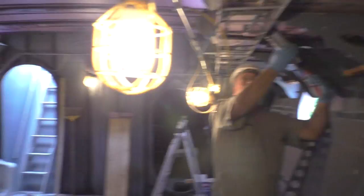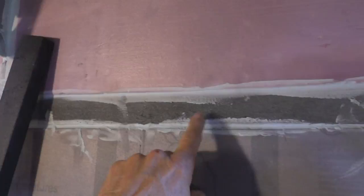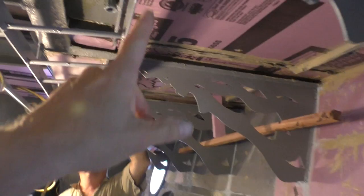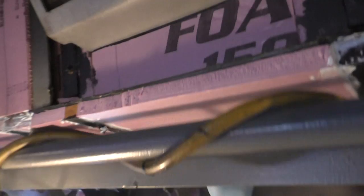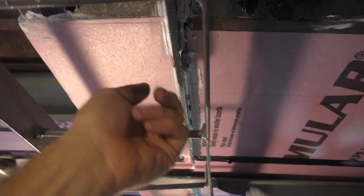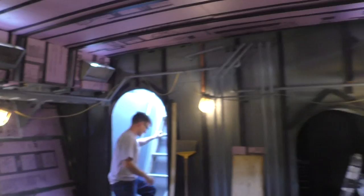That's Chief - say hello - and over there is Joel, who's been here before. Chief is new. What we're doing is putting the foam in and then sealing it up. This is a nice airtight layer - actually the second layer. He is caulking each of those panels very diligently using PL 300 foam adhesive.